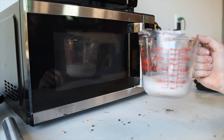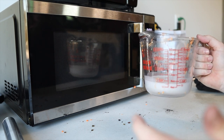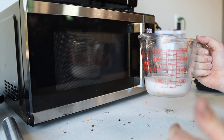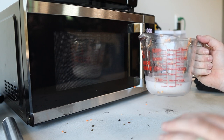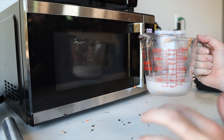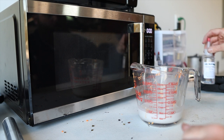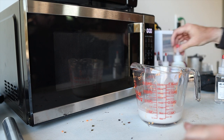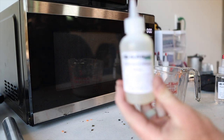One thing you can do is use an instant read thermometer to check the plastic temperature. I actually learned to do it by eye — I know what the plastic should look like when it gets up to temperature. I'm going to start incrementally warming it up, 30 seconds to a minute at a time. You don't want to just set it and forget it because plastisol will start to degrade pretty quickly the more heat you apply. One thing you want to do before you start cooking your plastic is add all the additives you want — not your color, just your additives.